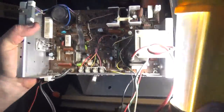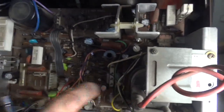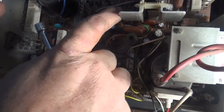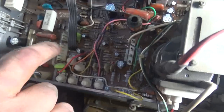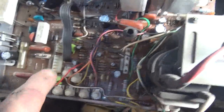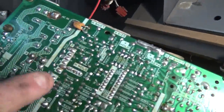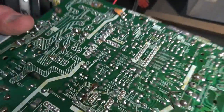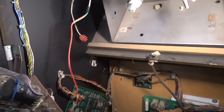Now I want to show you what we've done to the chassis. We've changed all the caps — all new capacitors are in it. We've also re-heated these two resistors, which tend to rock around. Importantly, you have to re-heat the data pins on the back side — re-flow solder along those two. That's critical because your picture could be in or out of sync, and your colors could shift.